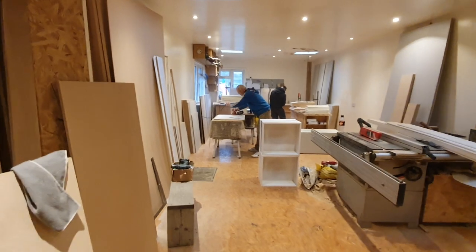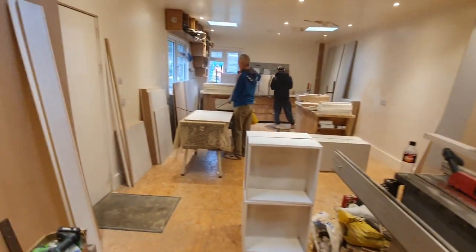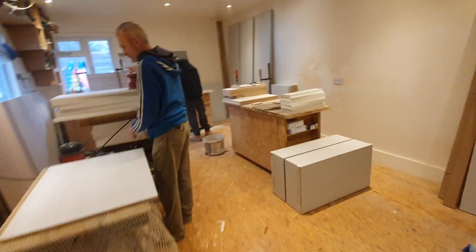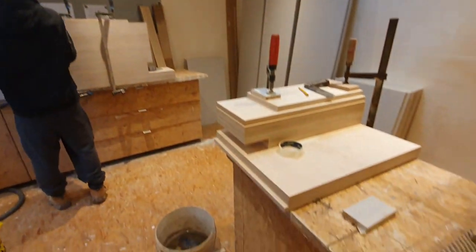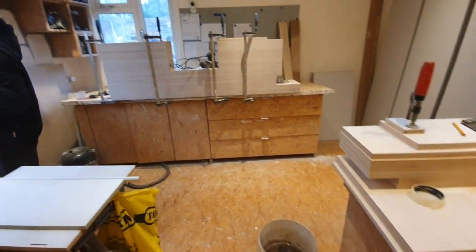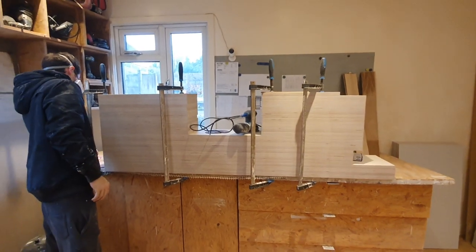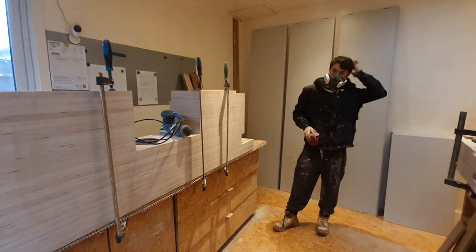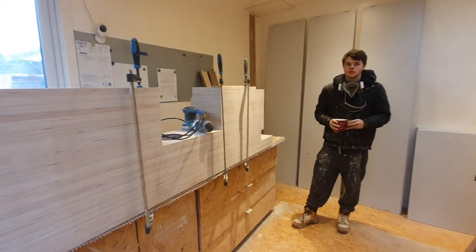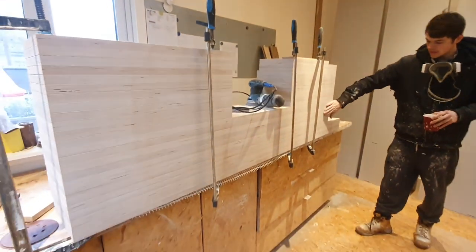That's what John's doing at the moment. It's not something we're going to get done before Christmas, but while we've got John here we might as well get some stuff done because it's going to be a push in January. Sean is on the birch - this is a four-meter tall by two-meter wide by 300mm deep bookshelf, all birch, with white Osmo oil as the finish. We're doing the stacking technique, stacking all materials up, and chose P40 in the end, then 60, 120, 240.